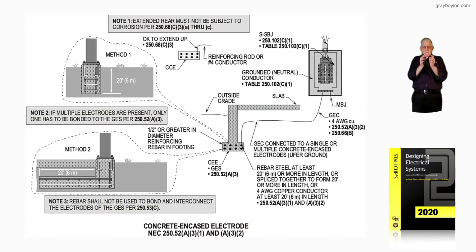When we look at 70B 15.9.9, an electrician doing maintenance or construction would look inside that panel board and ask why there's a number four in there — they should all be the same size. That would be true only if the grounding electrode conductor was connected to structural steel or a metal water pipe. Since it's connected to the concrete encased electrode, it could be number four sizing in accordance with 250.66B, so in this case it could be a different size.